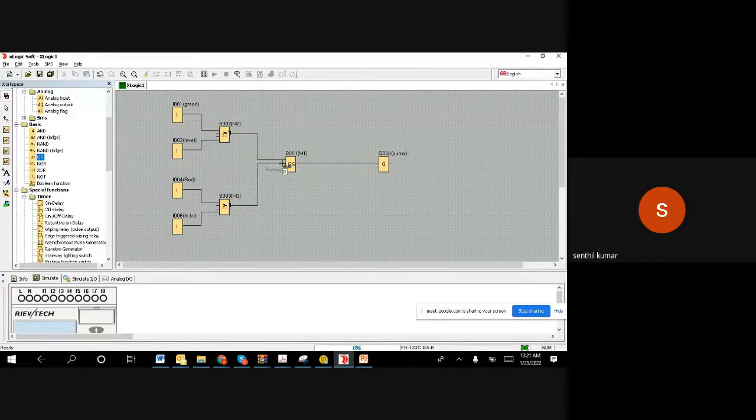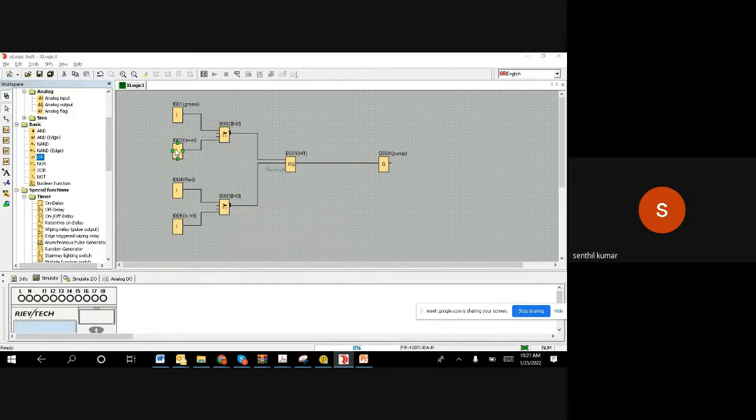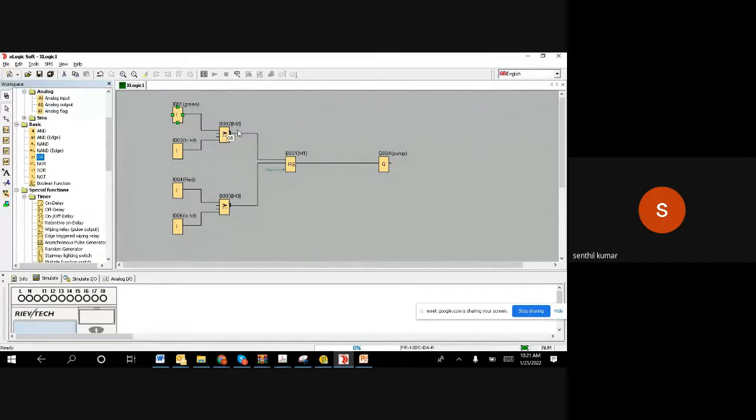It is a reset. So now with this logic, the green color push starts, level low, the high level, oh, so high. Okay, this is a low level. I'm sorry, a small confusion. This is a low level, not a high level. And the top one is the high level, because when the level becomes high, you want it to start. When you push the green color button, you want to start, or when the level becomes high, start. So anyone starts it. Then the same statement: when you push the red color button, stop, or when the low level comes, you stop. So it's a combination thing.